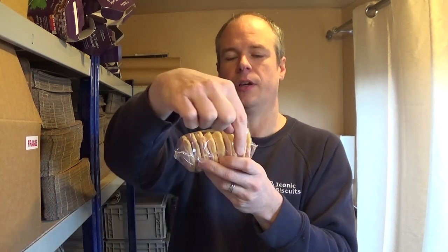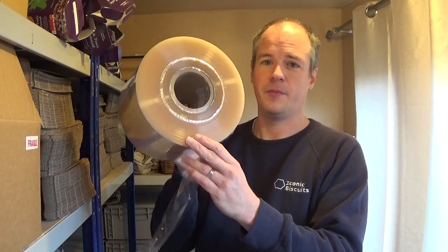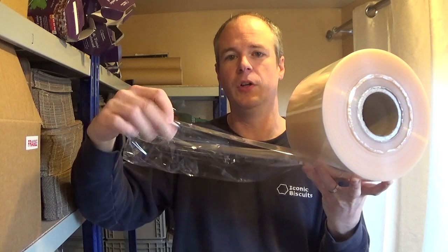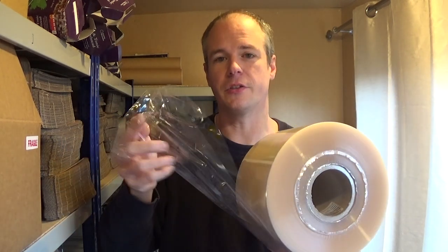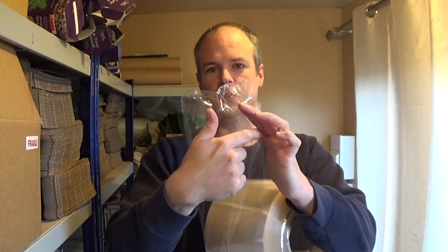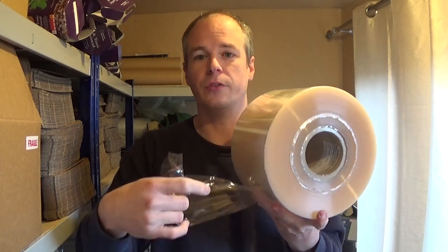Film: cookies go inside the film and it's sealed on two sides — that's the L shape. This is how the roll comes; they typically come in massive rolls — this one is 1,500 metres, and they're heavy. Centrefold film is a roll of film already folded in half. You open it, put your cookie inside, and press down the L-sealer. It seals it on the two open sides: your first seal seals here, and your next seal seals the open side and across the back of your cookie, which forms the first seal of the next cookie. They're easy to load — check out the L-sealer video to see how it works.